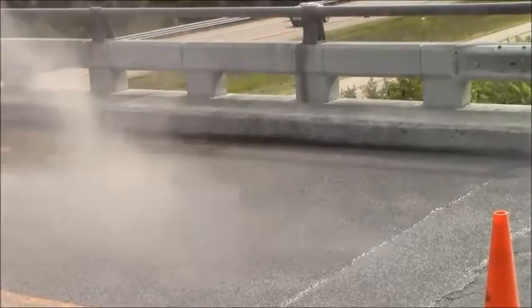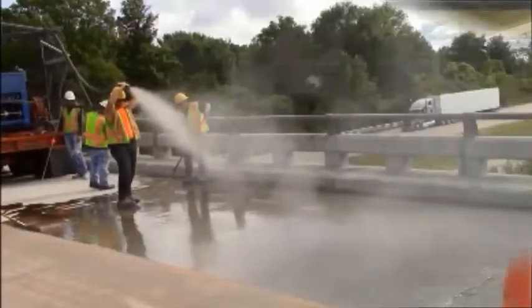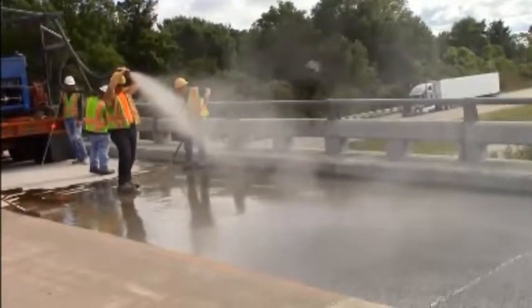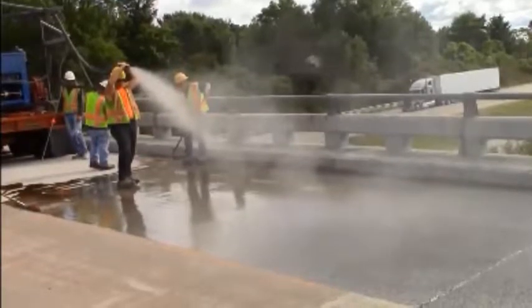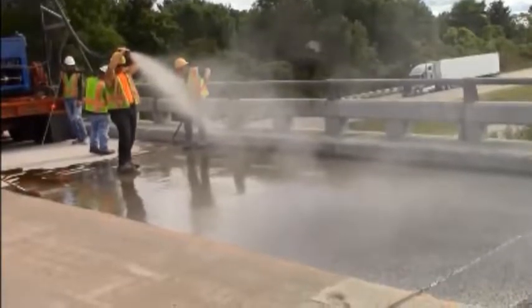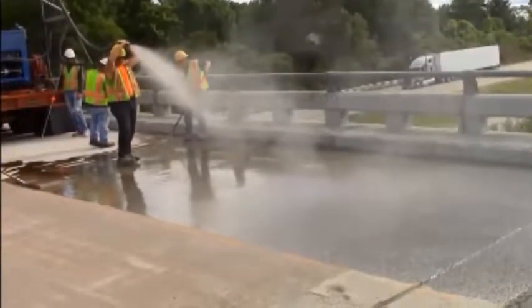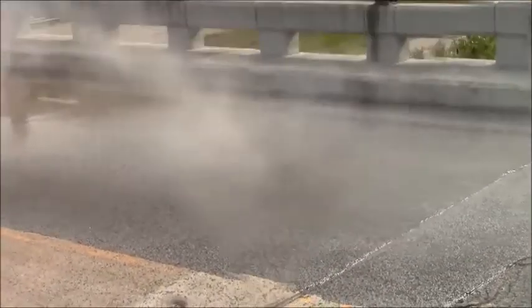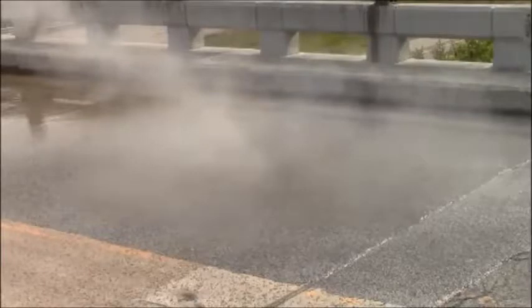Notice that the person responsible for broadcasting the aggregate has spiked shoes as well. It is important not to disturb the even layer of resin binder with regular work boots or street shoes, as this can create an uneven wearing course. An even riding surface is important for the longevity of the overlay system. It is considered a best practice to broadcast the aggregate in a way that allows it to drop into the resin binder rather than being rolled across the surface. If the aggregate is blown across the wet resin with too much force, it will roll in the resin, potentially creating an uneven wearing course.